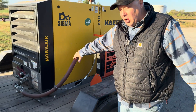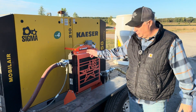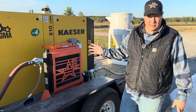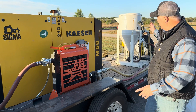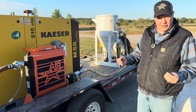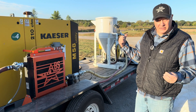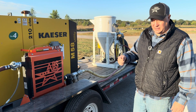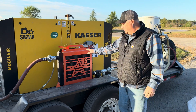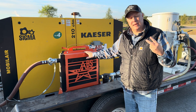Now we've got our inch-and-a-half air hose hooked up to the compressor and we hook it up to the after cooler. After coolers — not mandatory, but they almost should be. They're almost as important as the blast pot. A lot of people think that the sand is shot out of a blast pot like a cannon — it is not. It falls by gravity like sand through an hourglass. So if I have water in my pot, that sand is not going to flow well. It's a nightmare. These things turn your blasting into a one-man operation and you use less media because you can run it lean and mean.